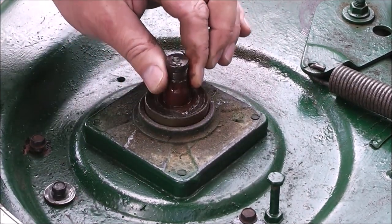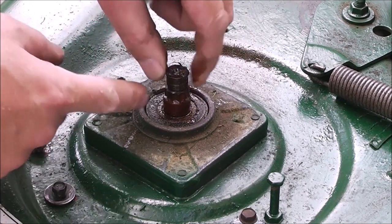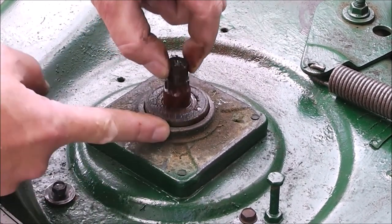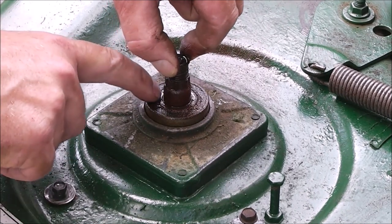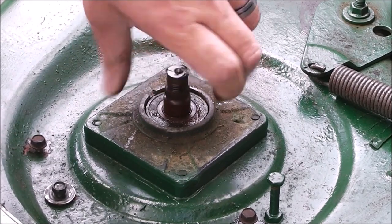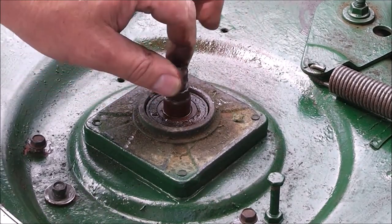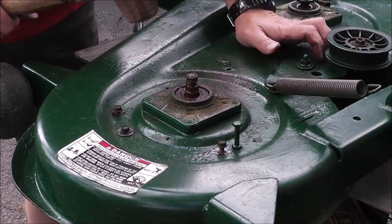We were able to drive the shaft through the pulley, but now the shaft is stuck inside the upper and lower bearings. See how the bearings are loose within the housing - you can replace just the bearings and that's what I want to do, but this shaft is seized right onto that bearing. Hear how loud that is? That's kind of why I did this - this one was bad so I figured let's just replace all of them. It won't go the first time? Get a bigger hammer.